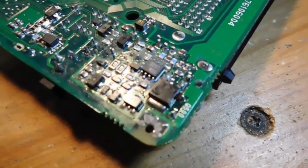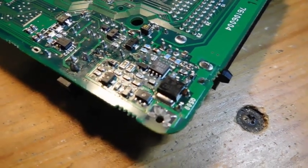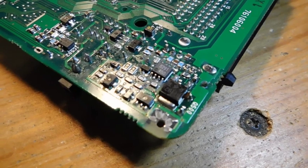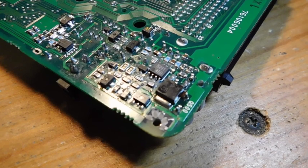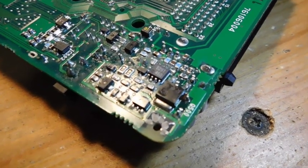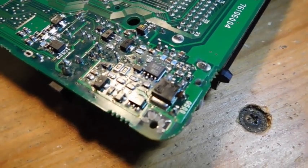That guy is also a voltage regulator — I'm going to put a link in the description for what type it is. I also want to thank my friend Ben from iFix Retro and also someone I wrote to on the forums named Neil — both of them were hugely helpful in sourcing exactly what I needed to replace these regulators. With their advice I got these two regulators, installed them, it was pretty straightforward to install. Now I'm going to go ahead and reassemble the unit one more time and hopefully we'll have a working PC Engine LT.